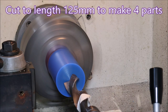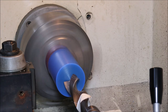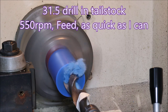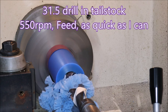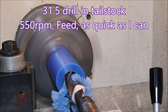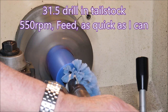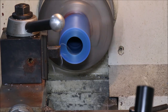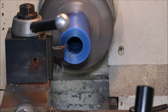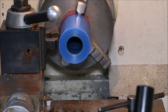I'm making multiple parts out of this piece of material, so the idea is to drill it first and then bore it right through to 42 diameter, which is the size it needs to be before the bearing bore is put into the piece. Next I just face it off to clean it up and then turn it to the 58 OD that it needs to be all the way along.